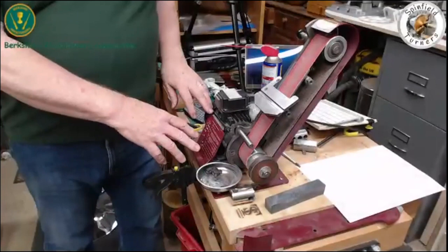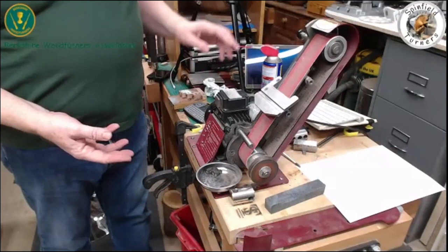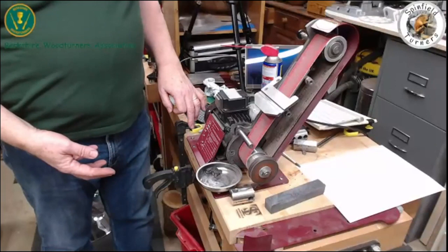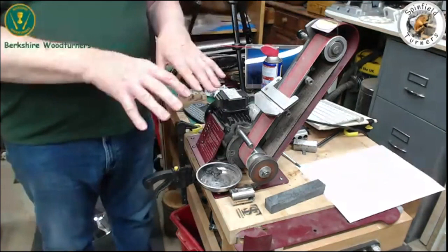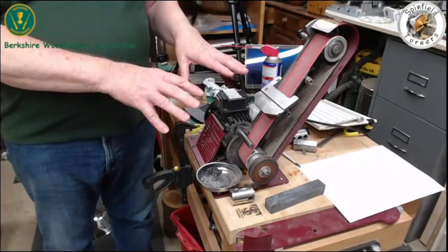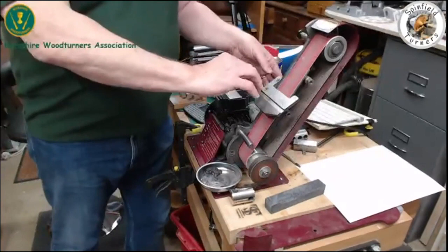My system is screwed to the bench because I just don't want it to skitter backwards and forwards. With bench grinders, when I didn't want to bolt it down, I've put a nut and a bolt through and ground the bolt to a V — to a sharp bit — so I can spike it to a surface and still lift it up and move it away. That's an option to consider, because this thing isn't going to kick around too much, but my worry is that if you're pressing on it, it could tip over.